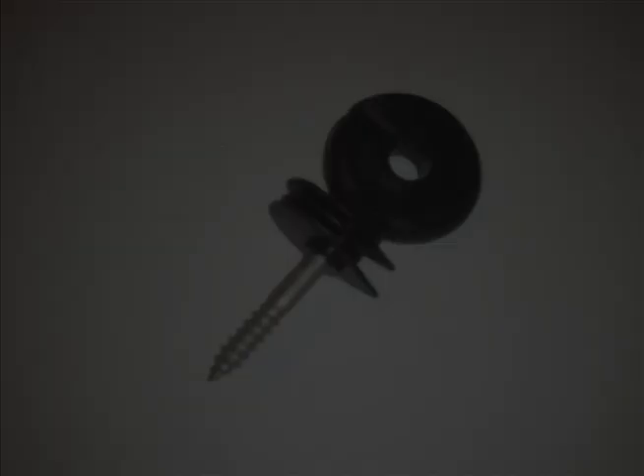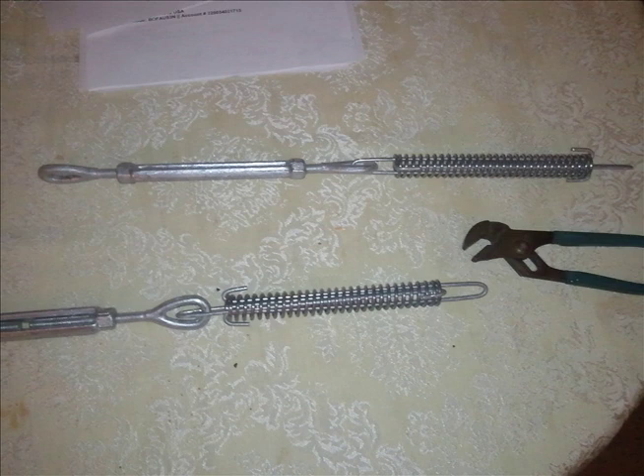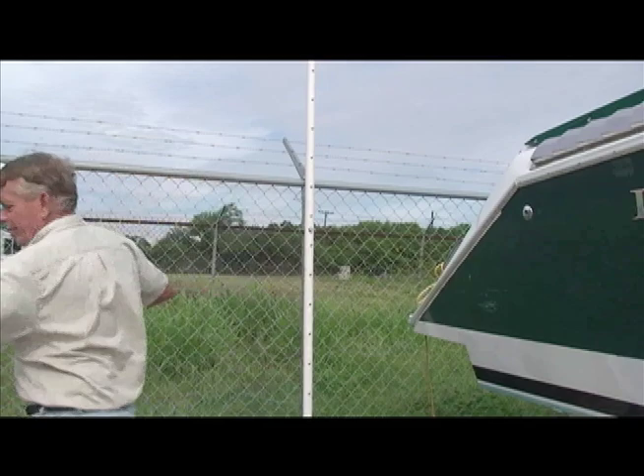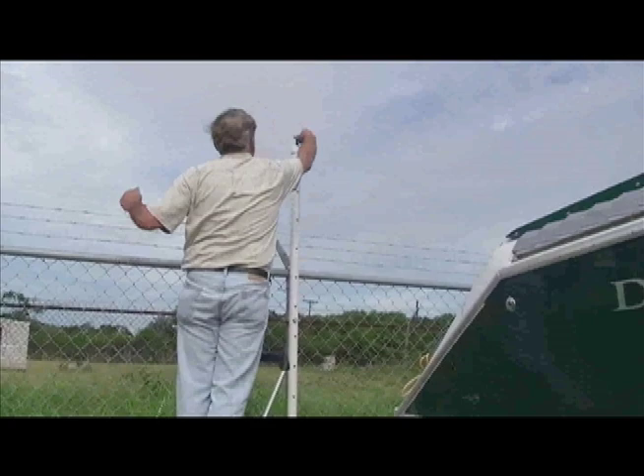Okay, we've got all the wires up and the last thing to do is glue the caps on the top of the post and install a black plastic insulator. Two reasons we don't use insulators all the way down: number one, the shoulder is so wide on them that you can't screw them into the post — the post isn't thick enough, it'd have to be solid — so you end up having to glue them in; the second reason is cost. Here's our completed fence. Down at the corners at the end of each row, we put a turnbuckle and a compression spring. This helps keep all the wires tight and gives you a way to take up slack, because there will be some stretching after it's been installed for a month or two. I pre-drilled holes in the center of the pipe caps, and at this point we've gone down the length of the fence, glued on all the caps, glued the insulators to the caps, and they've set up. With that little split in them, it's easy to go along with a loose piece of wire and just insert each one.